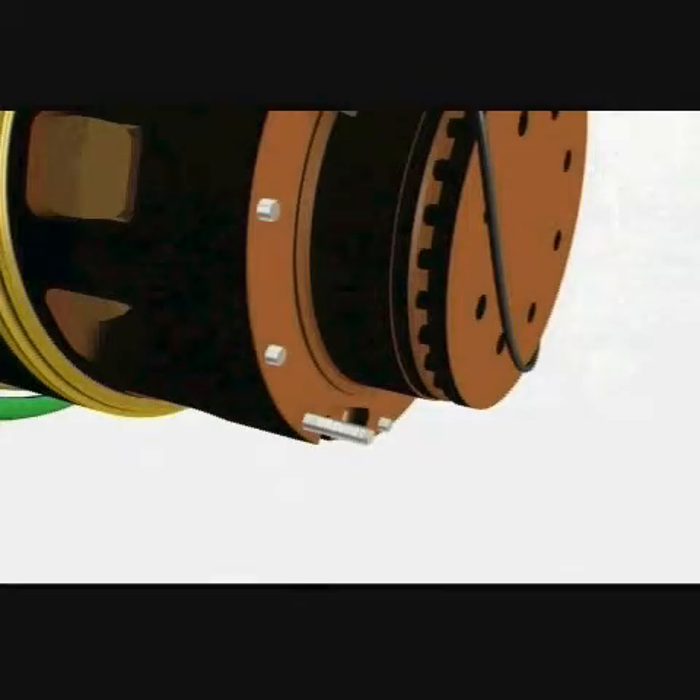The cause of the fatality was the pre-existing crack in the inner rim that was held in place by the clamping force of the cleats. Once Mr. S. Davis had released the clamping force, the ejection of the wheel assemblies was inevitable. There would have been no uncontrolled release of energy had the tyres been deflated before loosening the nuts. Mr. S. Davis would then have been in a safe position to remove the wheels, as on many previous occasions.